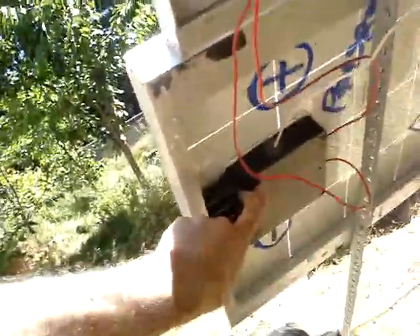I have negative connected to negative connected to negative, and positive connected to positive connected to positive. The negative end is connected here to the charge controller, and the positive end goes to this panel connected to the charge controller. I cut the wire that was coming off of this rack earlier and joined the two racks together. So now I have three charge controllers — one rack, the other rack — all connected. There's ground, there's negative, and there's positive.